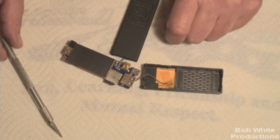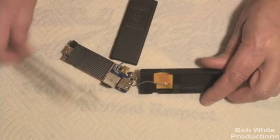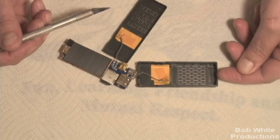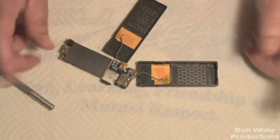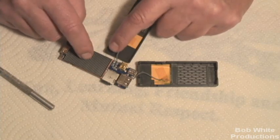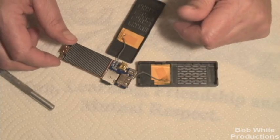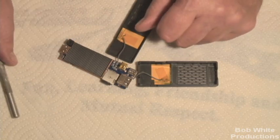Make sure you insulate those wires. This tip worked really well for me. I highly recommend you at least check your unit by taking it apart. To take it apart, it's got these little snaps on the inside all around — they snap into little notches on the case and they're pretty robust. I started at the HDMI port and just kind of pried it off and popped it all apart; it came apart pretty easy. I highly recommend at least checking yours to make sure it's not shorted. If it is, you can desolder that ground — it totally solves it. Or, the proper way: remove the antennas, replace the wires, or put on better antennas. Disconnect the ground and I think you'll find your Wi-Fi issues are fixed. I hope that was helpful — enjoy!